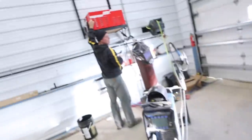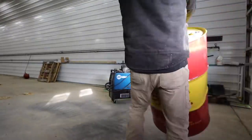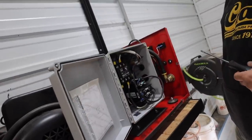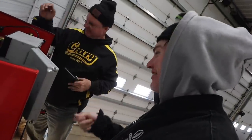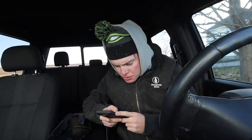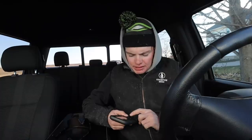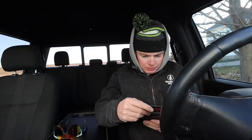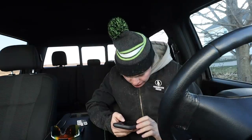Just when we thought we were done with harvesting and breakdowns — nope. The little power washer just decided to stop working. If you just stand here with the screwdriver and hold that in, I can power wash for a couple of hours. It's got a little button that says 40 amp right beside it. When I push that with the screwdriver it kicks on, but as soon as I let go it shuts off. He suggested I pry that fuse out and check continuity on that fuse. Apparently one of these three fuses is bad and we don't have a tester down there.